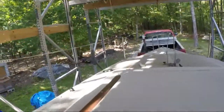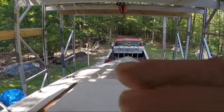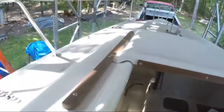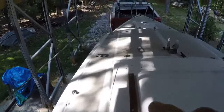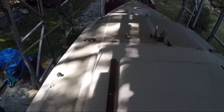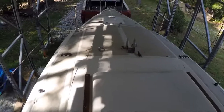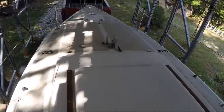It's plywood sandwiched between two pieces of fiberglass, from what I could see inside. The boat used to have carpet here, and when I pulled the carpet off you could see the wood up in there — it looked like plywood and everything was pretty good, except I did have one cut right in there. I filled it with epoxy, and later on I'll probably paint this deck and re-seal all the hardware again.